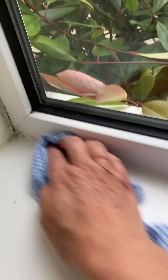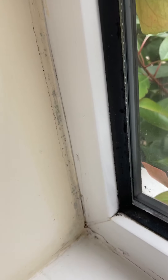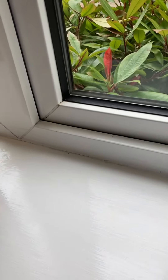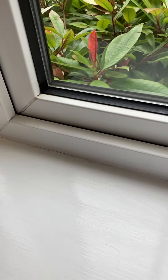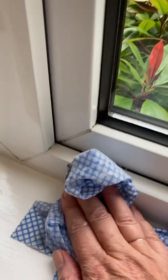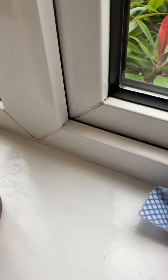What I suggest is one of you does one room and one of you does another room, then swap rooms, because you will see things that the other person didn't — little marks like damp. Take a cloth to it; it will probably just wipe off. Wipe your paintwork down. I need you to photograph all of this when you've done it, because you will have photographs of when you moved in. If this is wood and the paint is peeling, use your toothbrush and a drop of bleach to bleach out any black mold. Give it a scrub and wipe it. Have a bucket of water to rinse your cloth out.